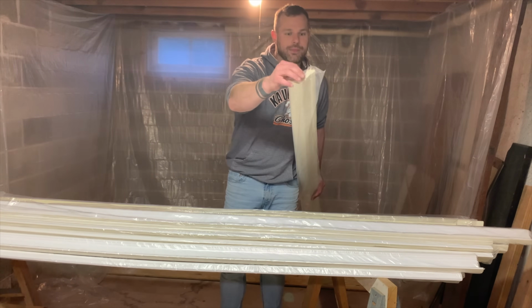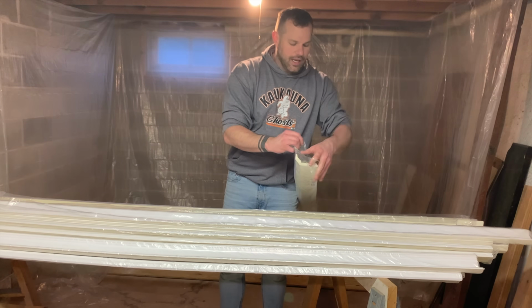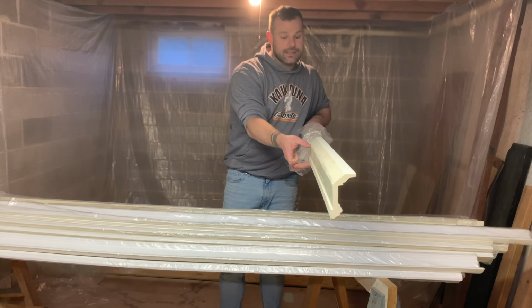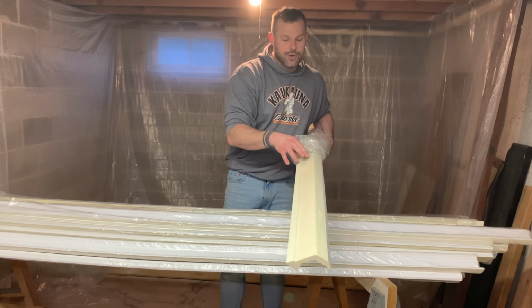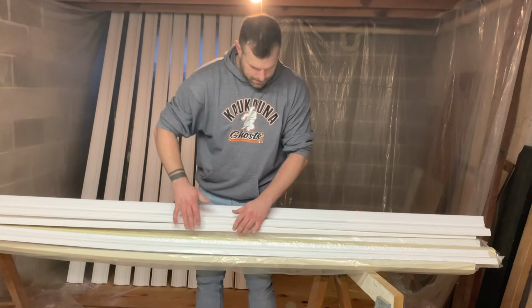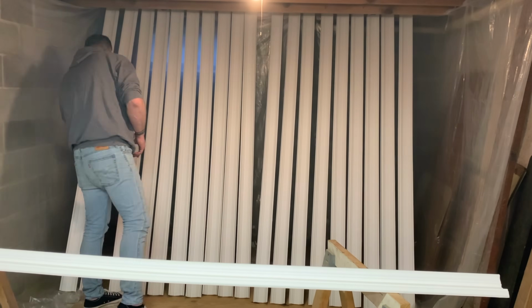You guys have been watching me as I've been layering all that wood on the ceiling, and that is because these will attach like that. So there's a big vertical piece on it, which is fantastic. And that will get glued and probably stapled, not nailed. And as I've said before, I want as much painted as possible before it goes up so that I don't have to paint over my head.